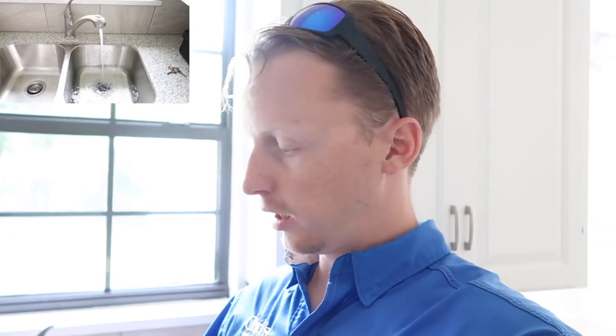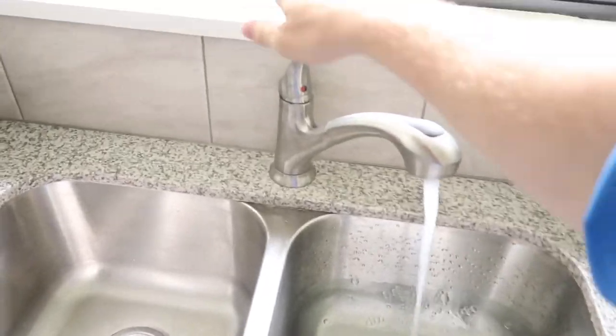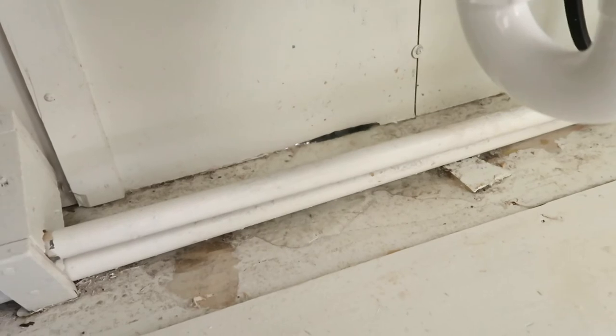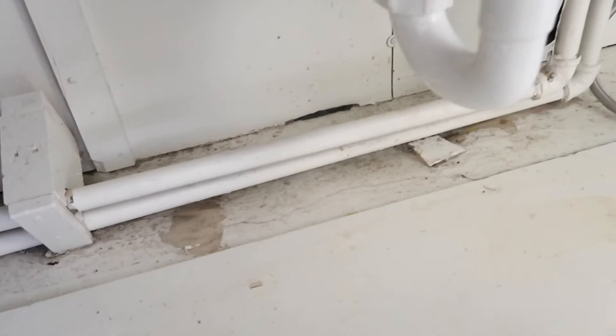Right here — I noticed the last time I filled the sink up there was some water outside, so I'm filling it up on the inside to see if I have water coming in underneath the sink. It looked a little damp but I wasn't sure if it was from the drain or coming from behind the wall. So I'm just filling it up to see what happens. Wow — that's a lot of water coming through the wall. That means there's a pipe disconnected behind the wall going to that cast iron plumbing, or there's some sort of backup. We definitely need to repair that.